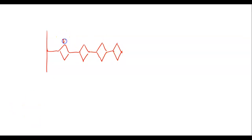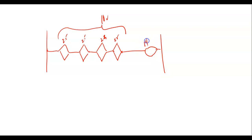Well, they're dropping 2.5 volts. This will drop 2.5 volts. This right here would drop 2.5 volts. This right here would drop 2.5 volts. So them suckers right there would be dropping 10 volts. I'm over here bringing this into a PLC or into a relay, and instead of having 24 volts, I've got 14 volts, and my relay won't even pull in.